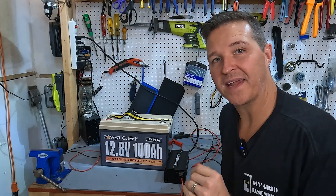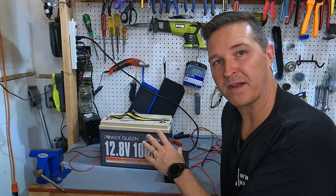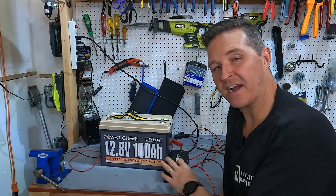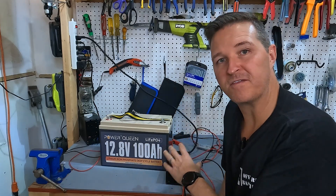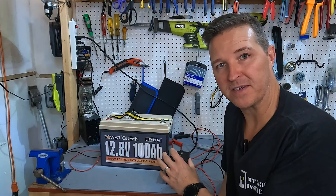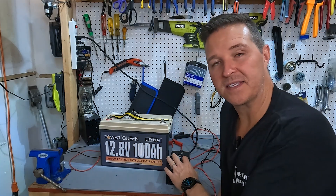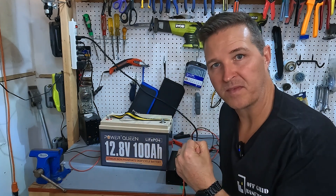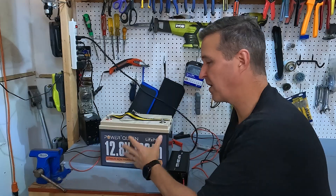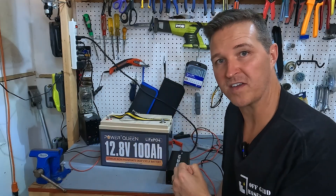Example two is the one that I highly recommend. I recommend that if you have a lithium iron phosphate battery, you get a lithium iron phosphate specific charger. This charger is for 12 volt lithium iron phosphate batteries — nothing else. The reason for it is because these chargers are zero voltage chargers, and so it doesn't care if the battery is at 12 volts, 10 volts, 8 volts, or 2 volts — it will start charging it.